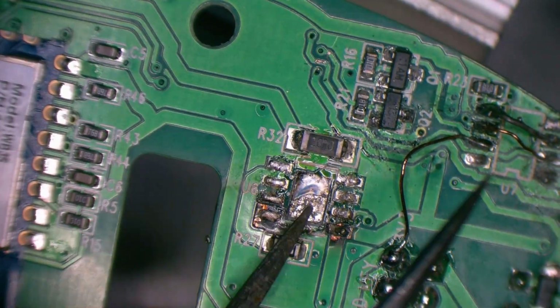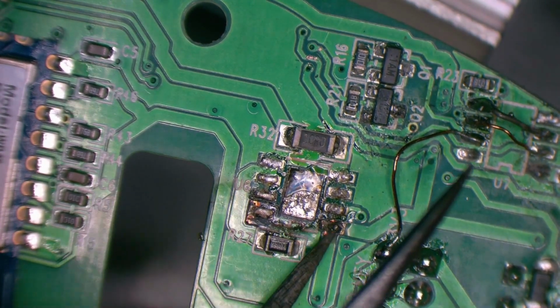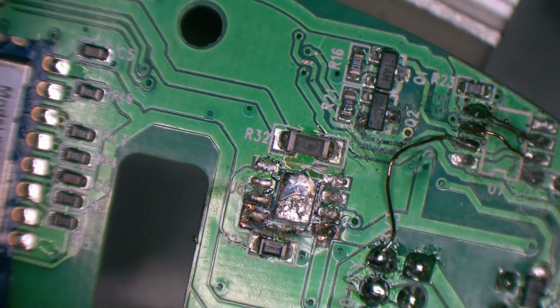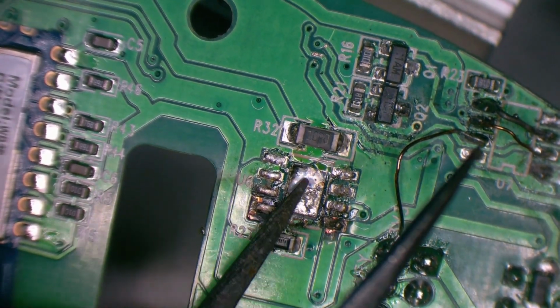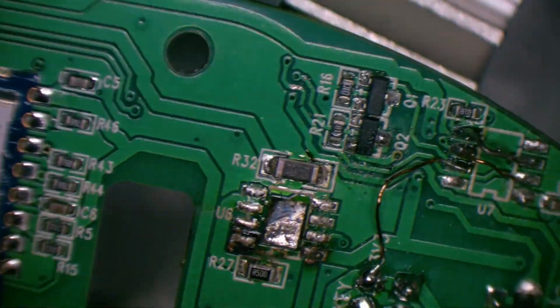We just don't have green. So I can order one of these ICs or something similar, and we can make green work again. I tried to parallel with another color, but that didn't work. I might need to change the reference resistor value for that. In the meantime, our blue and red work. Let me give you a demonstration.